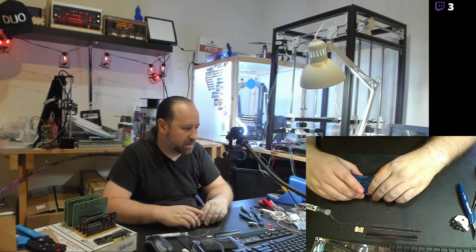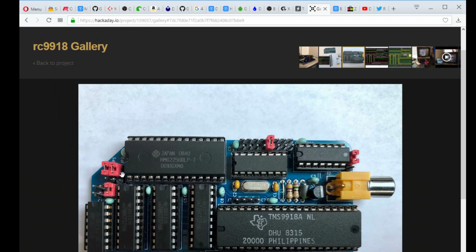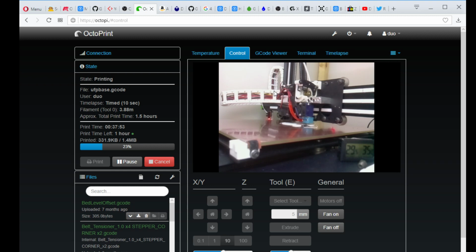No, it's not a Bowden setup. It's actually a direct drive. Let me throw up the camera on Octoprint here. It is the actual carriage that's on it. It's huge. And the entire right half of the carriage has nothing on it. It's actually intended for dual extruder, like full-on direct drive dual extruder. It's a huge carriage. There's a full-length NEMA 17 with direct drive straight on it. I do have a tube on it that is wrapping around the top. So it's at least a Bowden feed tube, but the driver is not on the back end of it.